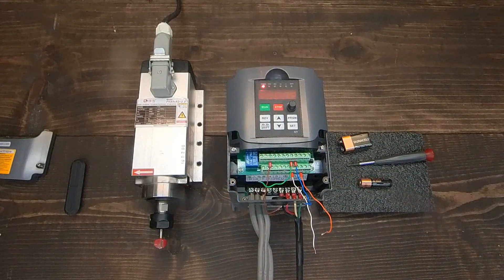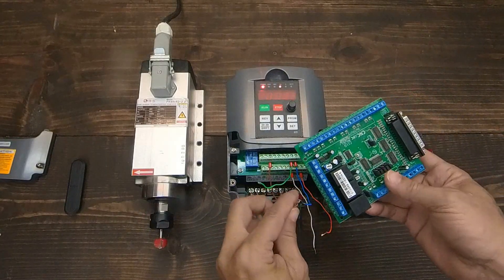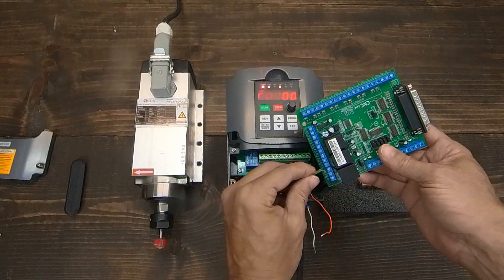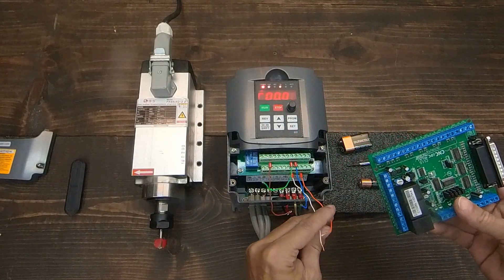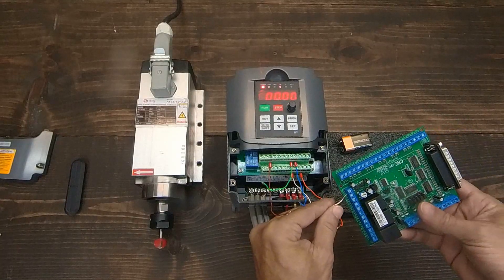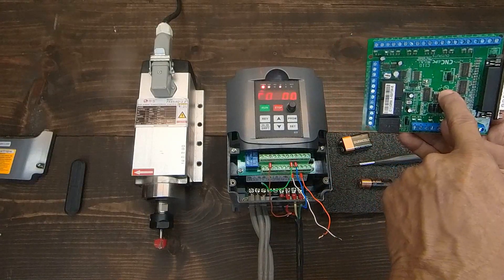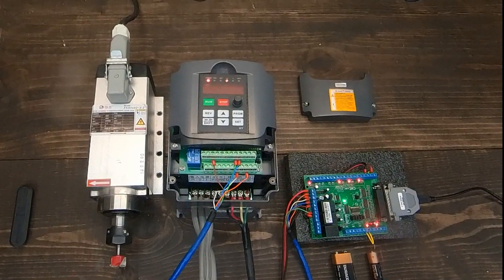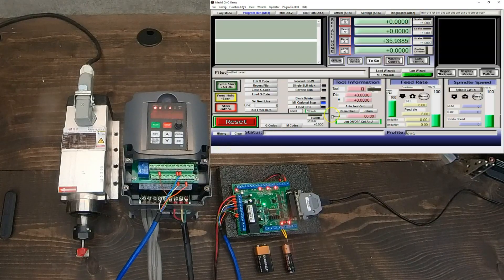Having tested by jumping the wires, now let's connect them to a breakout board. We connect FOR and REV to the normally open contacts of each relay, and DCM to voltage in — so one relay runs clockwise and the second relay runs counterclockwise. For spindle speed, we must connect 0 to 10 voltage to the analog output of the breakout board. For this C11G breakout board, we connect a 12V power supply to the analog terminals, VI of the VFD to the 10V terminal, and ACM to ground, to make the ground for the power supply and VFD common.